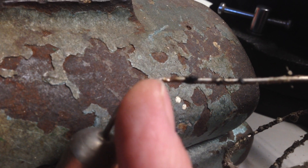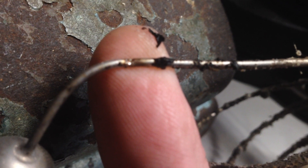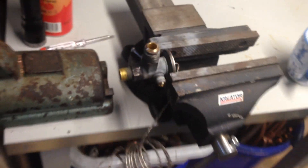You can see the line is cracked over here. The bulb is empty — it's not able to control the needle anymore. So we found the problem. I already ordered a new one. Guess what happened — the customer cleaned the machine himself and probably bent this a little bit while cleaning it, and that's why it rubbed on something.